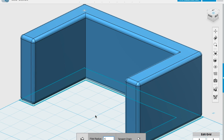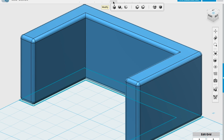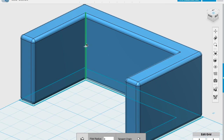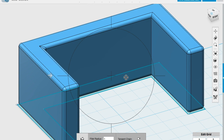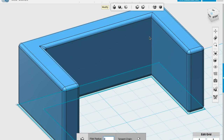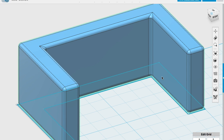I'm also going to try and fillet the inside edges. I'm going to put a one millimetre fillet there, and you can see that gives a concave fillet, which will actually help with the strength of this piece. Then I'm going to do the same thing on the other side using the fillet tool — one millimetre as well. So that will give it some strength there.